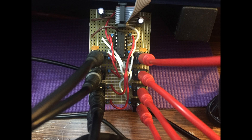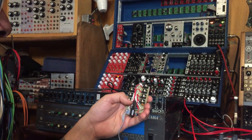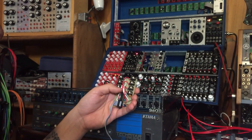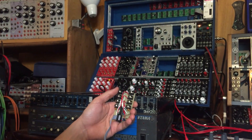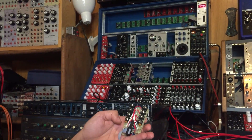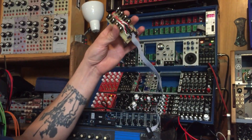So I quickly — it took me literally less than an hour to put this together. It's four input jacks, four output jacks going through one TL074 quad op amp setup. So it's four inverting unity gain amplifiers — basically it inverts the gates that you put on this side and you get them on this side. It's even got the decoupling capacitors.